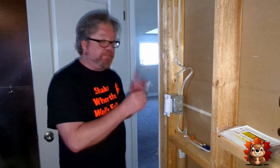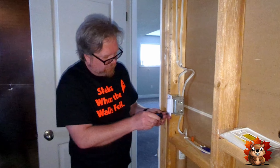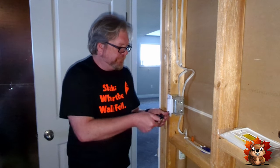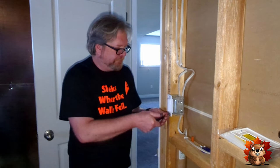I finished all the wiring. I have everything ready to go. The power is still off — I just have to connect the switch back up to the wall, then we'll turn the power on and give this a test. One thing I want to stress is that the unit is fairly large. It's not going to fit every single light box. You have to really get the wires pushed back. If your box is crowded, this might not be the best switch for you.